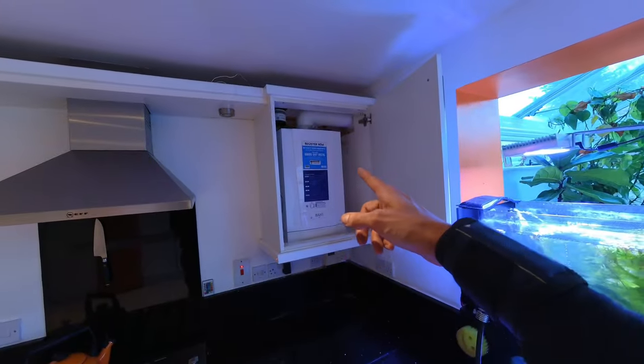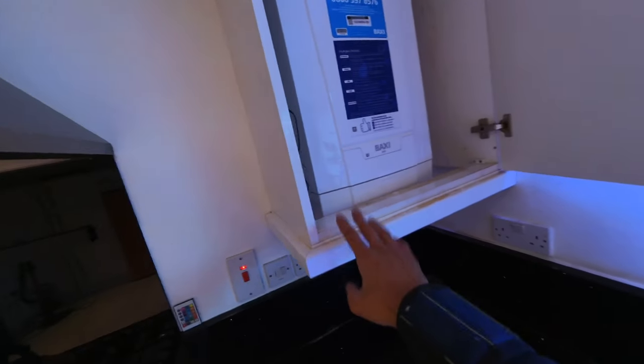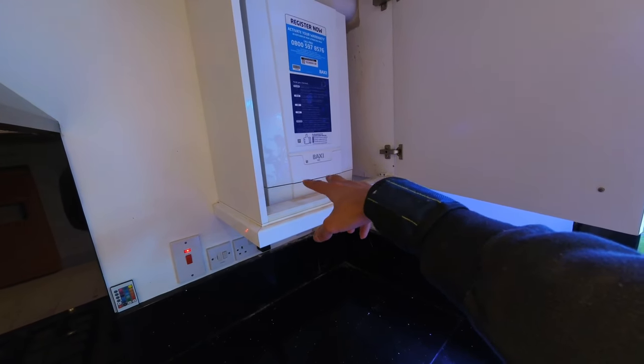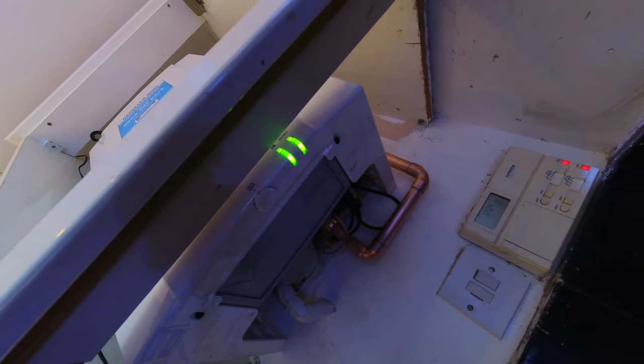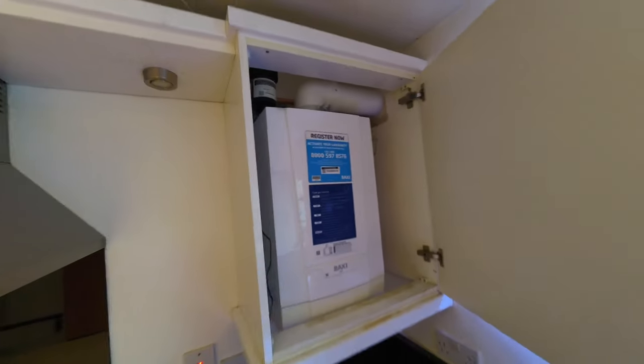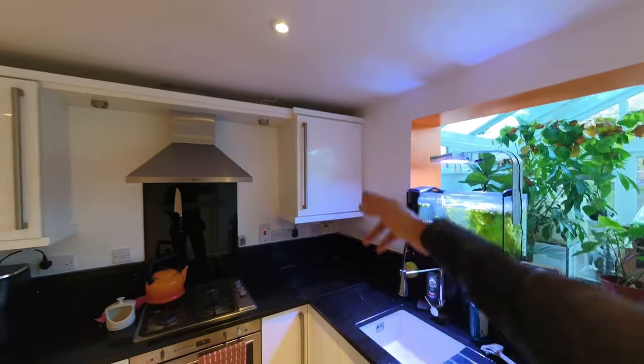Just like that, we're done. The unit is back on but easily removable — just a couple of screws, so when it comes to getting the bottom panel off it's easily done. Boiler's fired up, got the two green lights on there, all firing up running sweet. Filter is in, flue went straight out, fits in the cupboard — job done. Added inhibitor into the system and we're out of here. Got some breakdowns to do now.